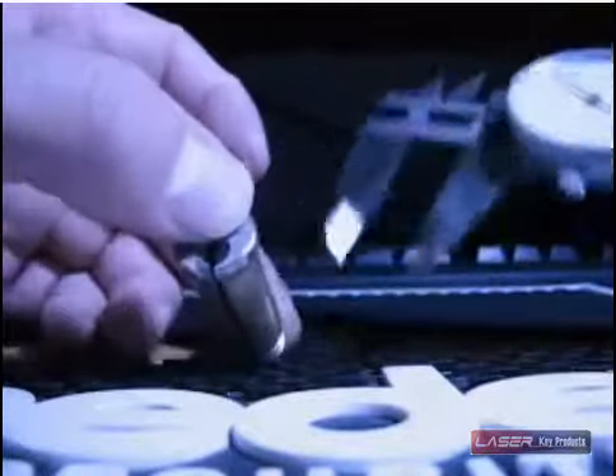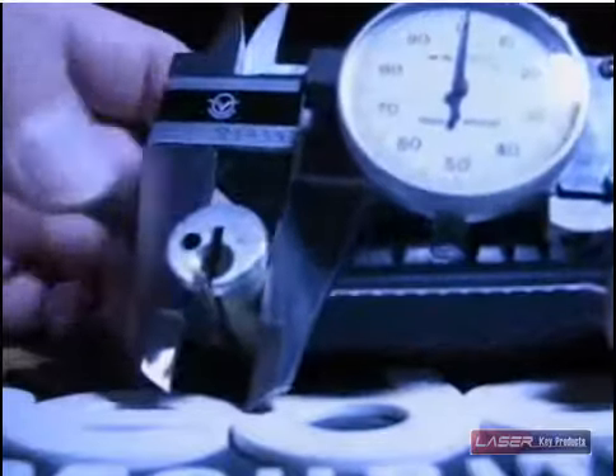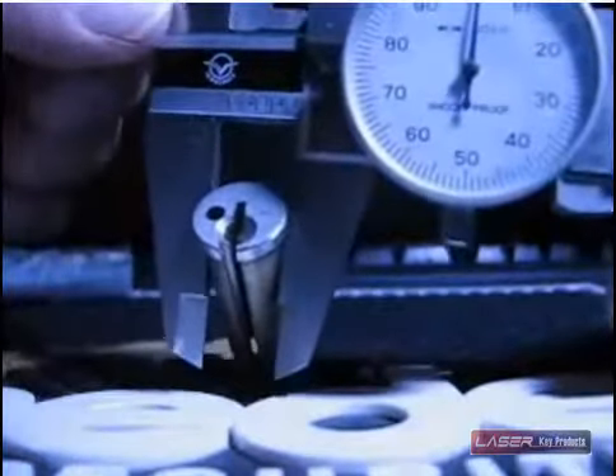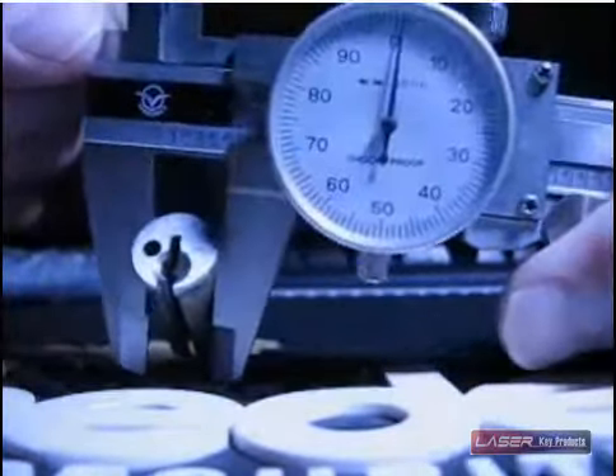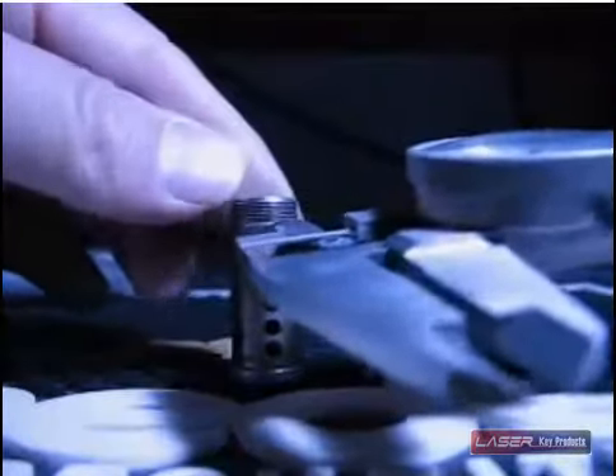So you could measure spacing also. If we were to measure this outside cylinder of this core, which we know is a half an inch, we can see that it goes to five and then right here is one — so that's five hundred and one thousandths. Just a hair over a half inch.